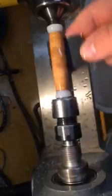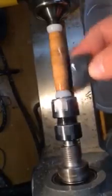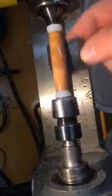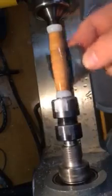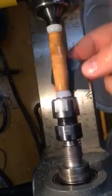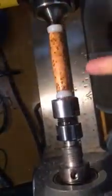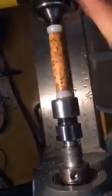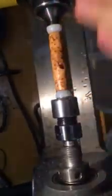When you get done wet sanding like this, if you just turn off the lathe and you dry it off and it's all dull, then you're ready to go through your micro mesh pads. This process right here will make the finish a glass finish every single time, because you're spending the time on the front end ensuring that all the deep scratches are gone and blended in. Okay, I don't see any deep scratches because there's no shining. If I wipe it and get it dry, it's dull across the entire blank.